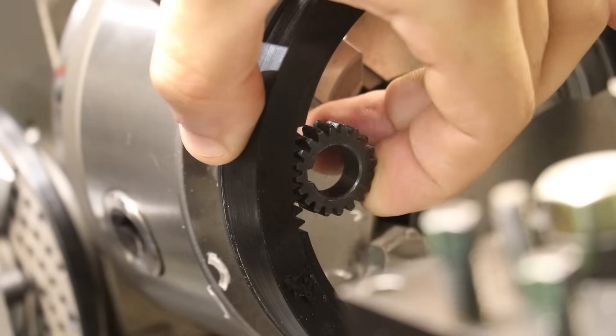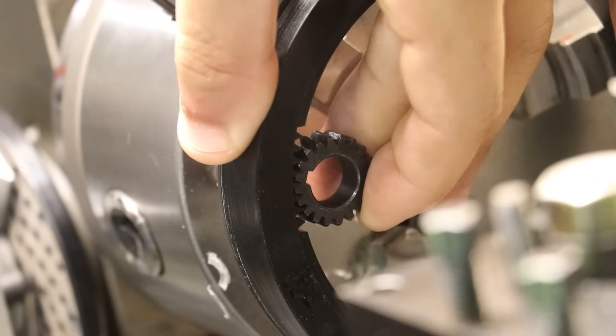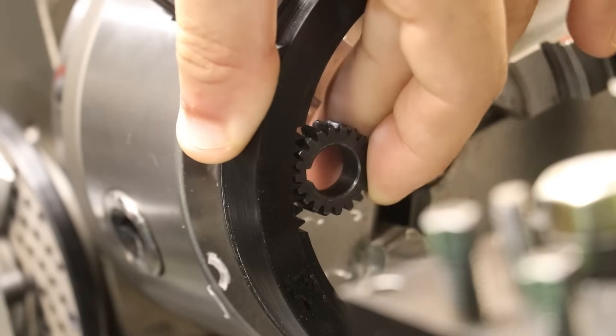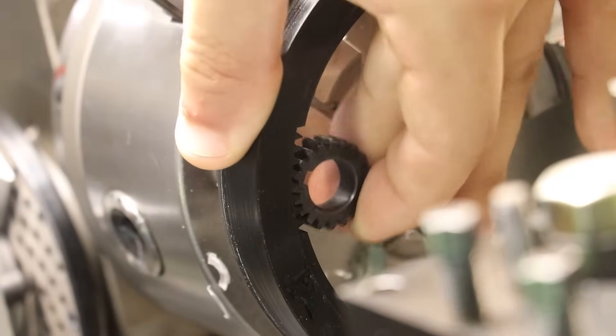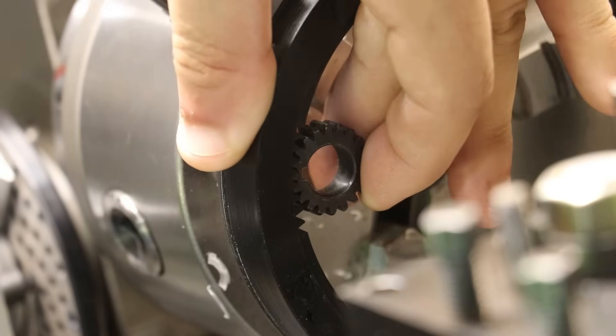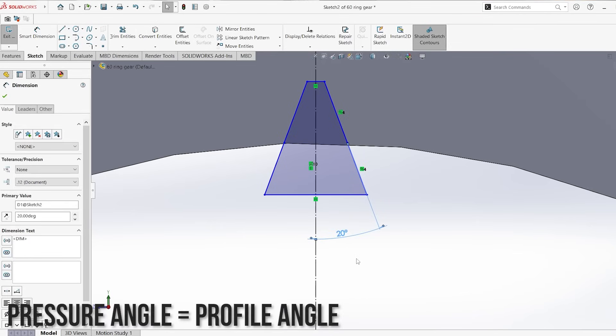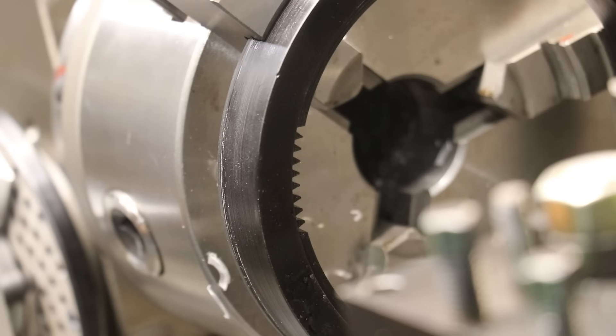On face value the teeth look okay - they sort of look like what you'd expect an internal gear to look like. However, once you add an actual gear the issues start to spring up. The gear teeth do sort of mesh, but there are a lot of spacing issues and a ton of rubbing and interference - it just wasn't very smooth. Even if you got this to work, you wouldn't want this as a gearbox. Unfortunately I can't widen the angle to create more clearance, because that would change the effective profile angle between those two gears, and when dealing with gears you need the two profile angles to be the same. So back to the drawing board.